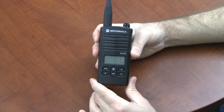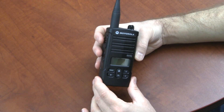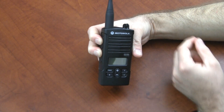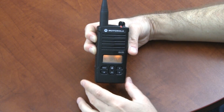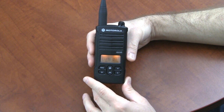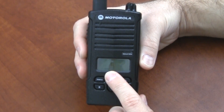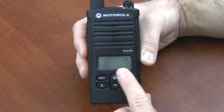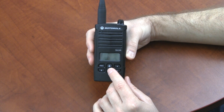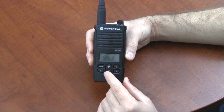The first step is to put the radio into programming mode. To do that, be sure the radio is off and hold down the two buttons on the side — the push to talk and SB1 — while turning the radio on. Continue to hold the two buttons down until you hear a beep, and then the display will have a PROG icon that indicates you are in programming mode. Channel 1 will flash on the display. In this demonstration, we're going to program channels 1, 2, and 3 to be narrowband, but this would work for any channel or any number of channels on your radio.